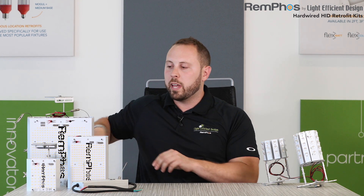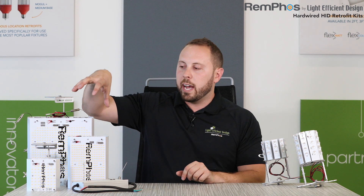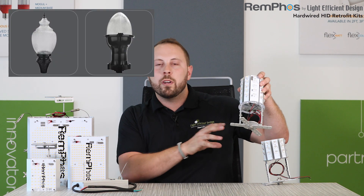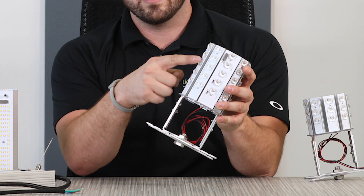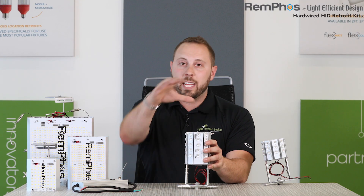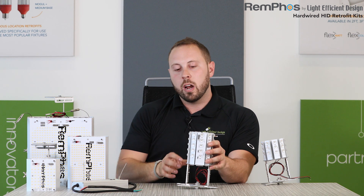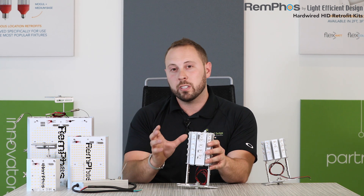Let's take a look at the options on the table. On this side we have our post-top retrofit kits, and on this side we have our LED block, which is our block format of retrofit kit. The post-top style retrofit kit is designed to retrofit post-top style fixtures. If I pull a unit here, you can see the interesting feature: optics built in on top of each LED, designed to direct most of the light to the ground. It's very wasteful in an acorn fixture to flood the top with light, since pedestrians are under the fixture, so the lenses throw the light down as efficiently as possible.